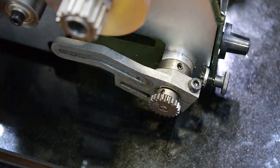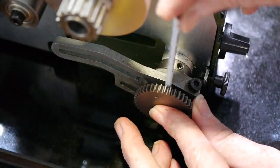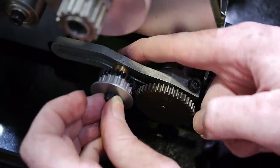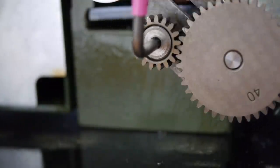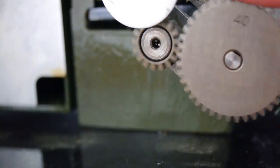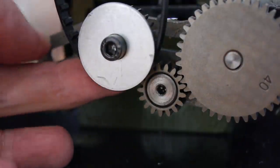Now to set up the gear train for the screw cutting feed. To cut finer threads, the Proxxon needs to have the larger lead screw gear installed. This is the custom change gear I made for 0.6mm pitch. You can see the whole build video via the card at the top right now. Because the thread I need to reproduce is left-handed, the lathe needs this idler gear installed to reverse the direction of the lead screw. All three gears need to be correctly spaced so they engage fully but aren't tight enough to cause resistance. Finally, the whole chain is connected to the spindle via this belt.